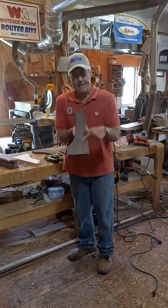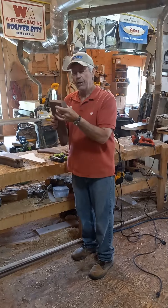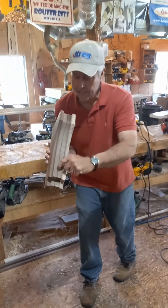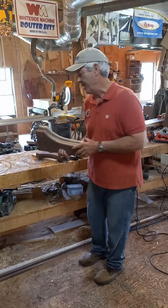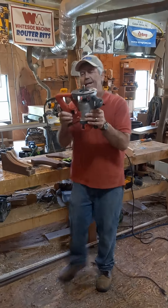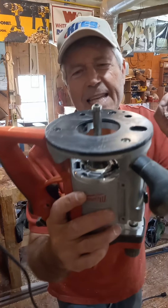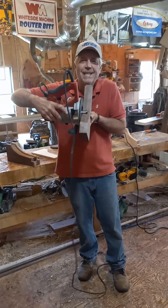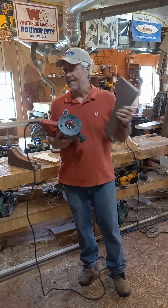So now I had one piece that exactly matched the pattern. I cut another piece close with a jigsaw, and we clamped, headless pinned, and glued those two together. If you look at this piece, there's just the slightest little detail — a tiny, tiny little V-groove — and that keeps me from having to make an absolutely perfect joint. I used this flush trim bit, which has just the tiniest little edge that cuts that V-groove. By lining up so that V-groove falls right where the two pieces join together, I can flush trim it to as close to an exact duplicate as possible, and that little V-groove gives me just a tiny bit of forgiveness.